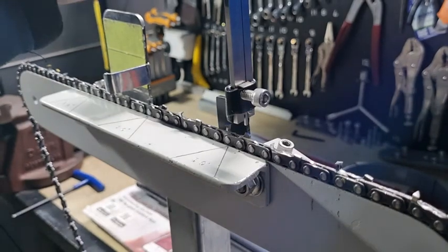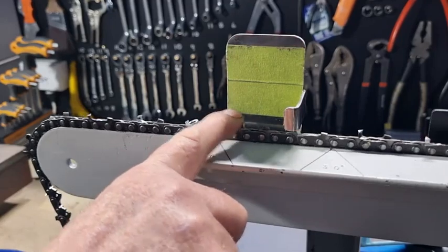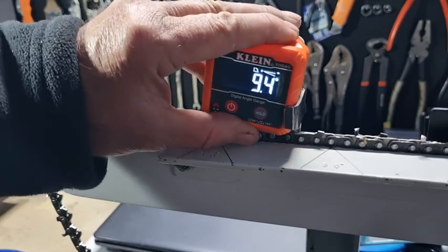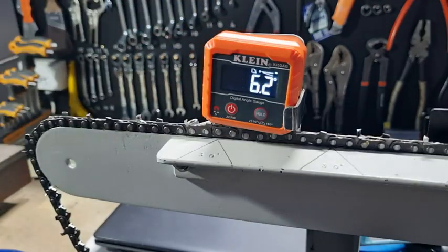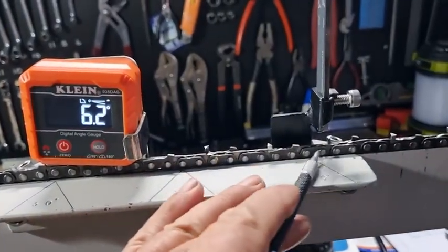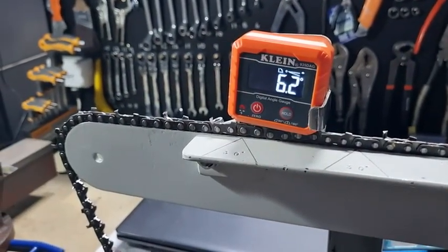Then what we did after that — we'll just lift that back up, take that same tooth and bring it over here, and we'll put the digital angle gauge on here. You've just got to be careful using these digital angle gauges — you can get all sorts of readings. They're very sensitive, and also movement in the links can give you a false reading, so you've got to be very careful. That was the same tooth that was up here — you can see it highlighted in blue — and we had a depth of 1.35 and we've got an attack angle of 6.2 on the hard setting.